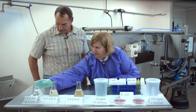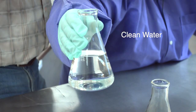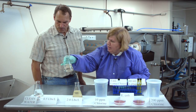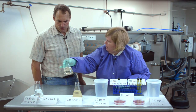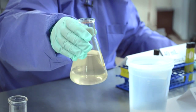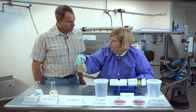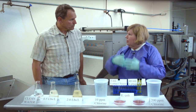Sure, I can tell you about this. This is the clean water that we end up with after we process a very small amount of lettuce — a half a pound — and we end up with a solution that looks like this after the lettuce is removed. It's a little bit tinted green, but it's starting to get a little bit foggy. That's the turbidity that's starting to develop, and that's caused by this organic material that builds up. In this flask, we have the liquid that's left over when we process two pounds of lettuce, so we see that it's getting cloudier and cloudier. That turbidity — the cloudiness — represents what's happening with the organic load.